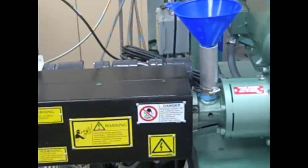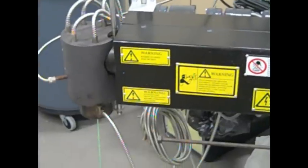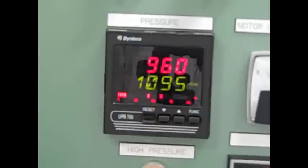The polymer melts as it moves down the barrel towards the die section. Because the die is a much smaller orifice, pressure develops. A strand of molten polymer at a constant thickness comes out of the die. Notice how it is a nice, well-mixed material.